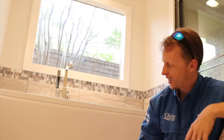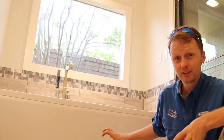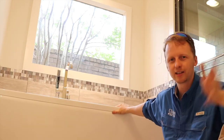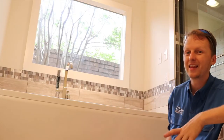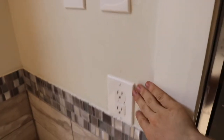I'm going to hit this tub and try to knock it all out at once. It's pretty much installed wrong from top to bottom, but I didn't get any leaks on it, which is impressive. Every time I see one of these plastic tubs, they're never installed right — they're always loose. The faucet is also not installed properly; there's no lockout from it moving left or right, so it can easily spray water on the floor. They didn't even finish installing the floor behind the tub. The biggest concern, though, is that they have a plug and a switch within arm's length of the tub. You're not allowed to have any switches or electricity inside the shower or bathtub area — so that's definitely a no-no.